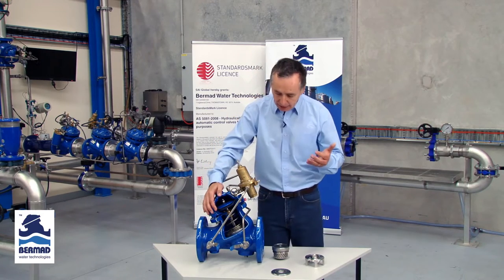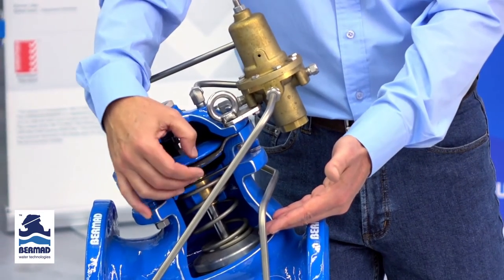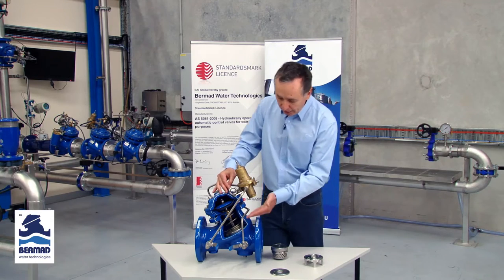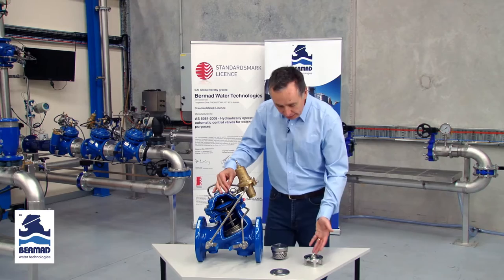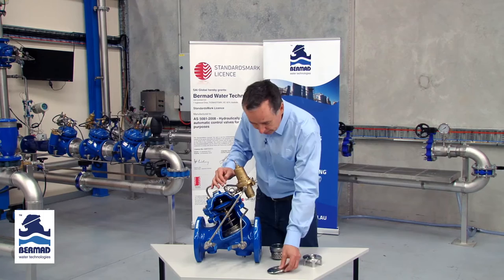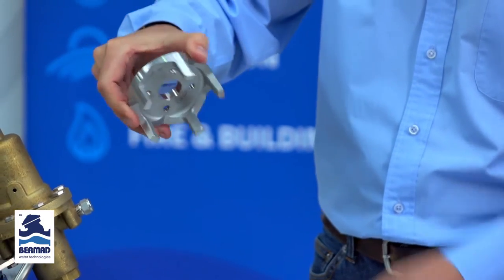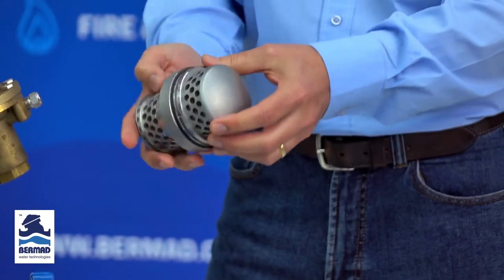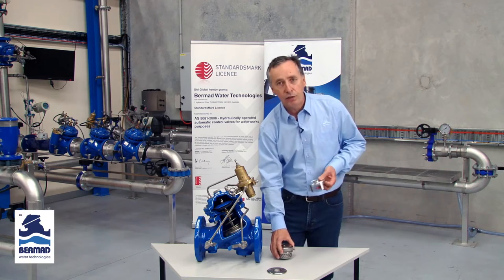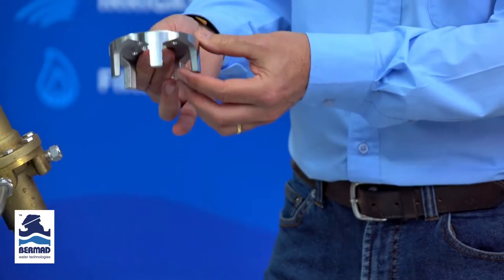The diaphragm is completely free from any of the water flow running through the valve, so pipeline debris, stones, or anything inside the valve are not going to influence or damage the diaphragm. At the lower end of the actuator, we have a series of different arrangements: a flat disc for exceptionally high flow capability, a V-port throttling plug which gives the ability to provide different characteristics, and under extreme conditions of high differential pressures, we can utilise anti-cavitation cages. At the heart of all that, the product with the utmost success has always been the V-port throttling plug.